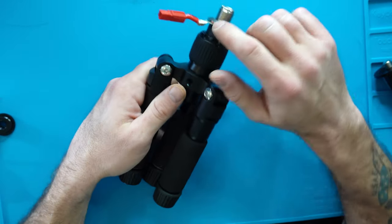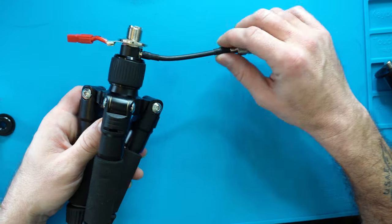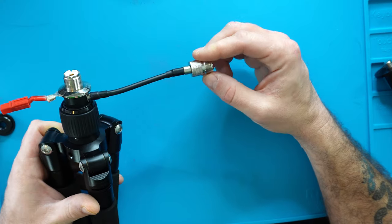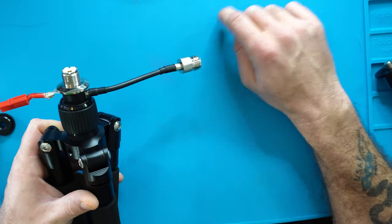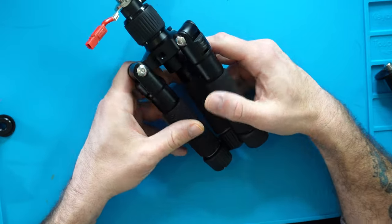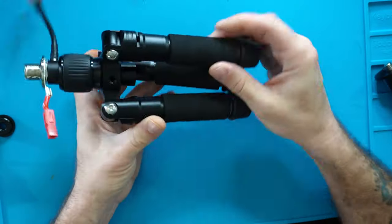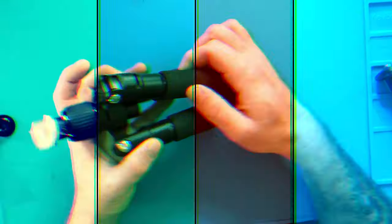We'll show you out in the field in just a minute, so stand by to see how this looks out there. Overall, what happens is you have a little piece of coax that comes out to another SO239, and it allows you to plug in a PL259 coax and then into your radio. This is kind of unique — it's compact and portable — but I do need to take it out in the field because it's going to get big.